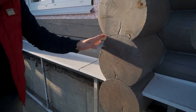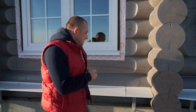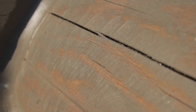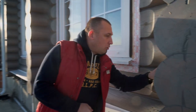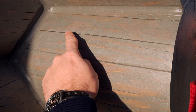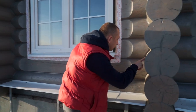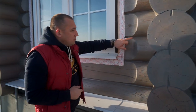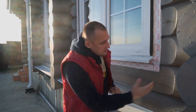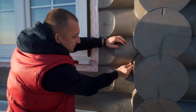I've checked the house from the outside, and it's a pretty strange log rounding geometry — I don't know where they got it from; it differs a lot from what we do. Here's another interesting thing: the house is coated with a very expensive product — Osmo with sparkles, seems like 1143 — but it's been grinded with an angle grinder, there are lots of scuffs, and then it's painted. If it's not prepared correctly, the coating is not working well. It doesn't matter if it's a premium product — if not prepared correctly, it won't last long. And if they decide to sand it with all this sealant inside, how do you sand it without hitting the sealant? Just look at this gap — it's 5 cm of sealant there. And then they say that a wooden house is all windy and cold. No, guys, that's design flaws.